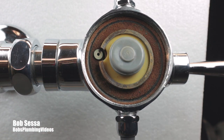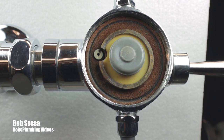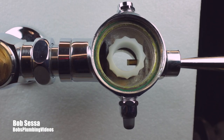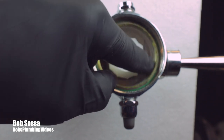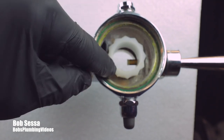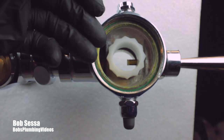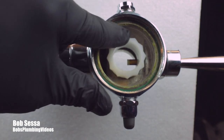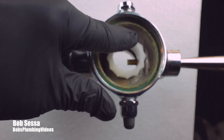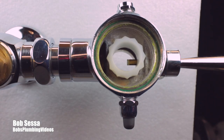Let me back this up — I'm going to pull this out and show you what this actually looks like. Here's a shot of the inside of the flushometer. I removed the insert, and here is the plastic seat. You can equate this to a faucet seat because that's where that leather washer sits down on top of. Once pressure gets into the upper chamber and pushes it back down, this is what creates the seal between the leather washer and the seat — kind of like a faucet.